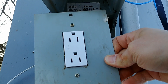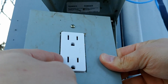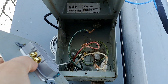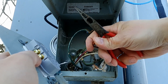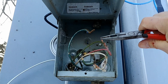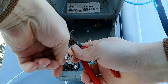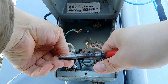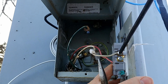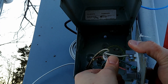Now, technically you can install the receptacle in this orientation, and that's the officially recommended way to do it, but I just like them better this way. On the right-hand side here we have our gold terminal — those are going to be the hot terminals — so our red wire in this case is the one going there. Previously these were clamped into the GFCI receptacle, so we're going to have to bend little hooks. You want to make sure you bend them in the direction that the wire will be twisting — in this case to the right — and then the neutral obviously is going to be on the other side, so we'll bend that the other way.